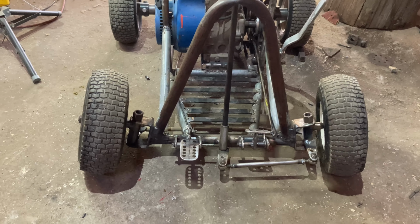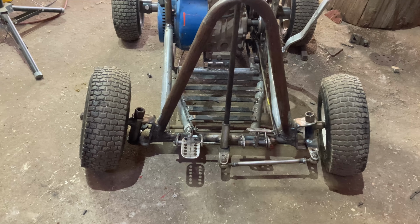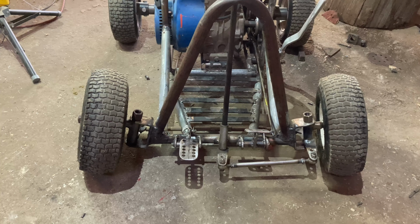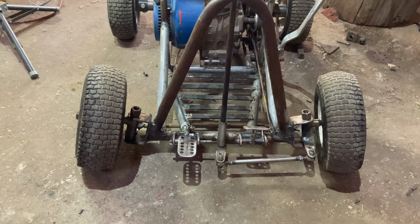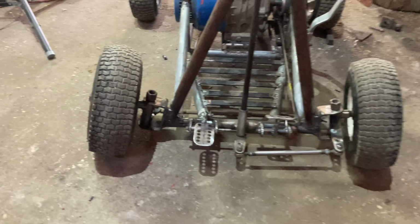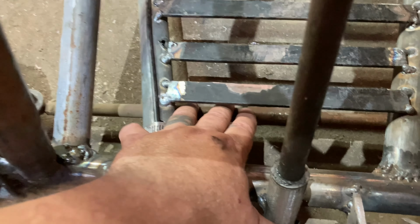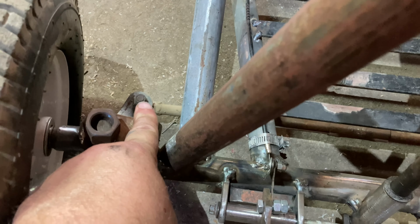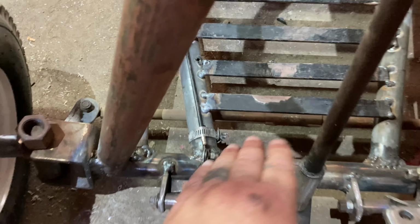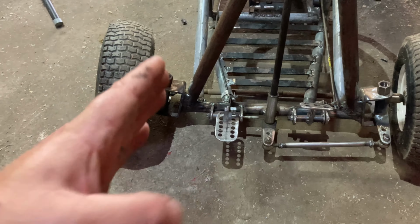With the drift sleeves on there, it'll probably be a little bit better, because you'll have slippy and grippy, just like an open differential. One wheel won't turn, won't grab, kind of thing. But until we cut that tie rod right there and shorten it up a little bit, because I've got the adjusting all the way in, so we're gonna have to cut it, shorten it up a little tiny bit so that I can get the toe to turn out like that.